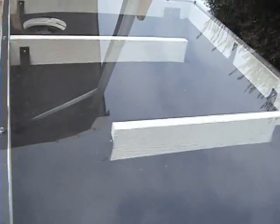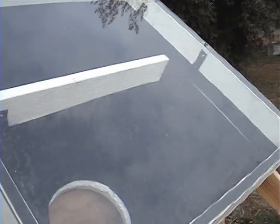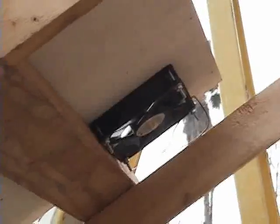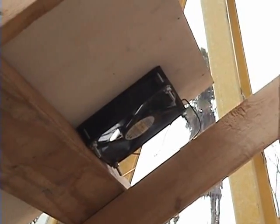The black material absorbs the sun's energy and transforms it into heat. That is made out of just aluminum sheet painted black — it absorbs the sun's heat and conducts it. The air flow produced by this fan up here captures the heat and brings it into the trailer. I put the fan on the outside of the heater because the extra distance between the fan and the plexiglass enables better air circulation.